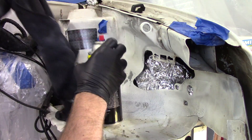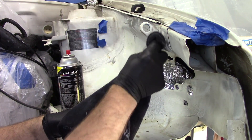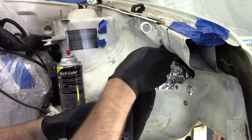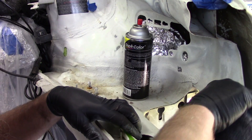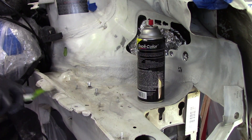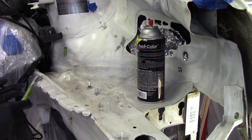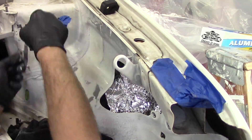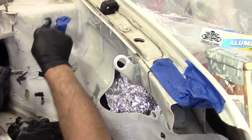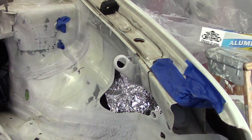In a perfect world we would remove every bit of paint with media blasting to ensure the best possible coat and coverage. Since that's not really feasible here, we're going to use a paint prep spray and clean thoroughly to make sure we get any loose paint, any wax, any grease off of the surface. We also want to make sure that we scuff any old paint as well. This is usually the part that takes the longest, and don't forget to work in a well-ventilated area wearing safety glasses, a mask, and gloves because this stuff usually really smells bad.